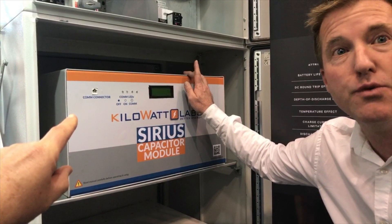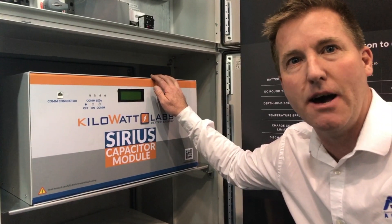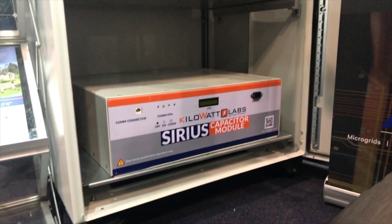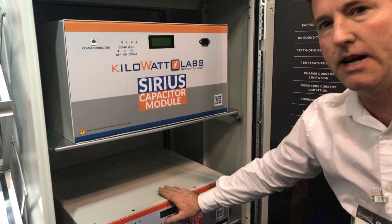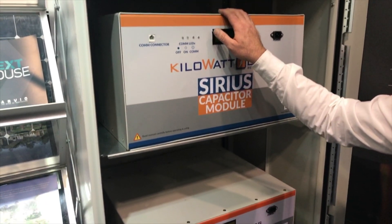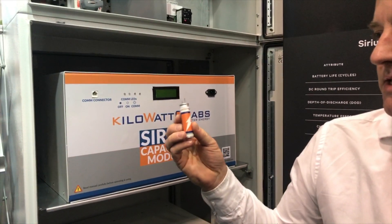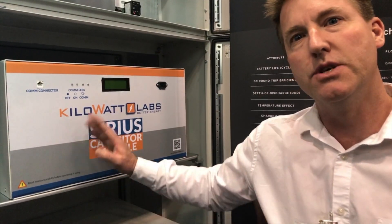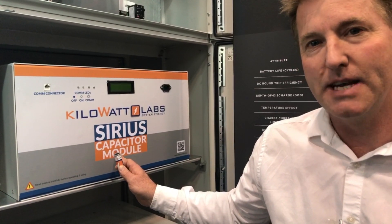It's 100% usable — 7.1 kilowatt hours of usable energy. You can discharge it in 30 minutes, so it's a 14.2 kilowatt DC output and input. If you put two in parallel you've got 28 kilowatts of DC power available. There are two sizes: the smaller unit is 3.5 kilowatt hours and weighs 75 kilos; the larger is 7.1 kilowatt hours. Technically we could fill and empty these in 30 seconds, but it's too dangerous — imagine discharging 7,000 watts in 30 seconds. So we restrict it to 30 minutes.